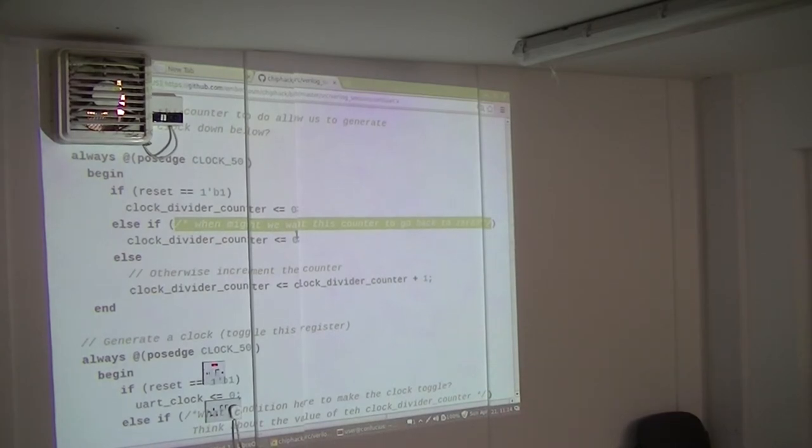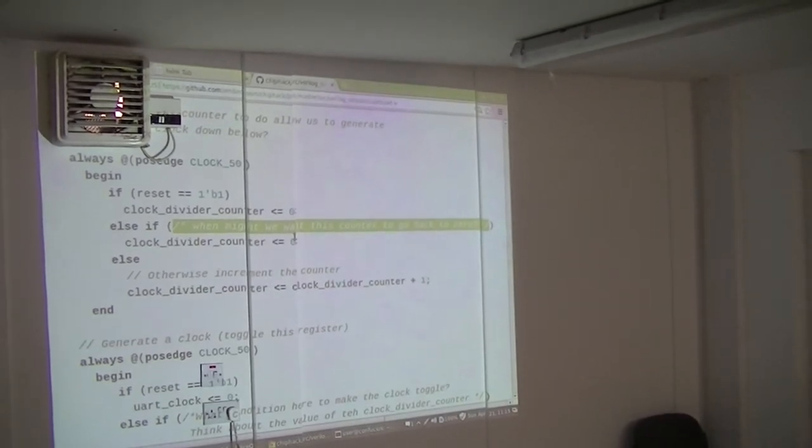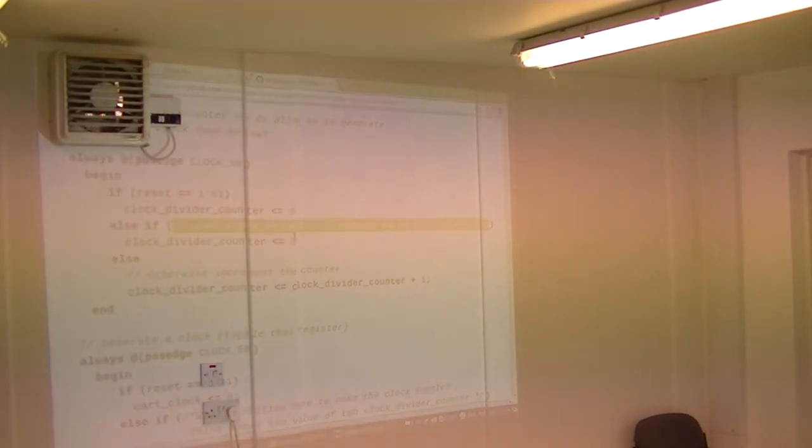So we've got a 50 megahertz system clock, right? Can you guys see that? I'll write really big, don't worry. So we've got a 50 megahertz clock. The clock period of that, the time you've got for every single clock period, is 20 nanoseconds. It's your frequency, and the period, usually T, is 20 nanoseconds. So from here to here, that's 20 nanoseconds. Okay. Very good.